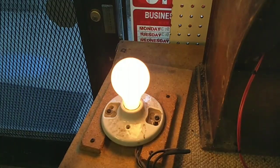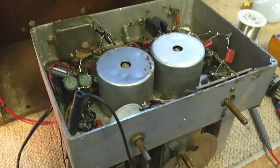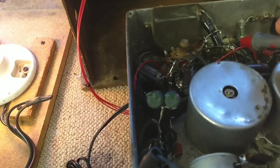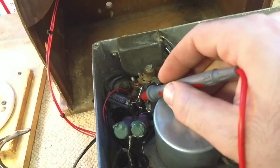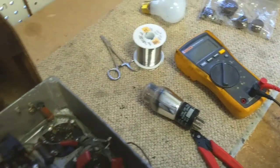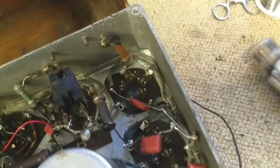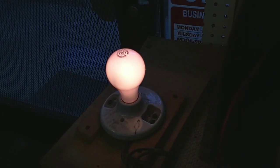Well, that's better — not as bright. Let's see what our voltages are here. 163 — that's a lot better. And then downstream of that we've got 93. Let's see if we can see anything lighting up on top of the chassis. Hard to see past the getter flashing. I don't see any tubes lighting up, but that could just be because of the bulb. It's glowing dimly enough that I think I can put a 60-watt in there.